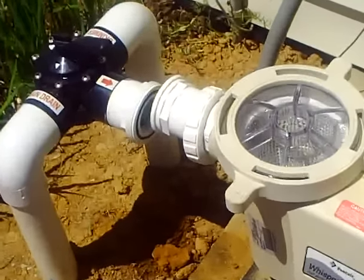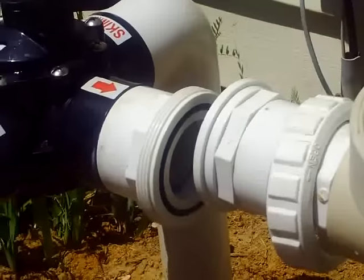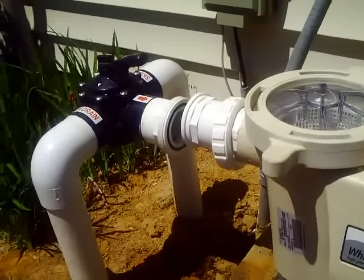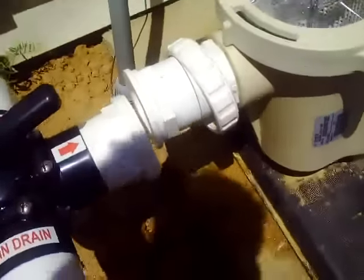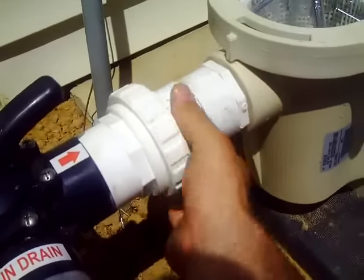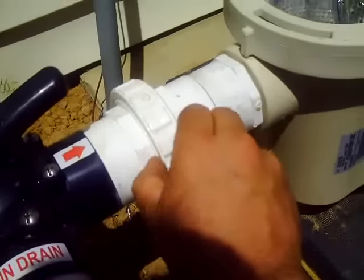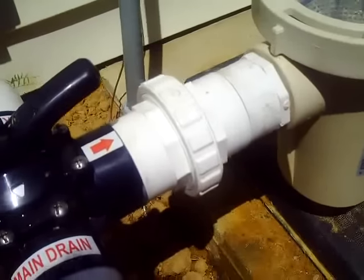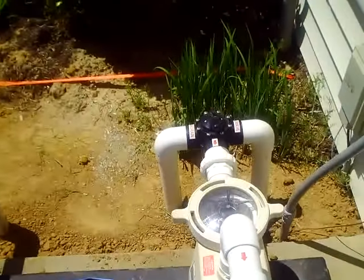One other angle of our union here — you can see that O-ring needs to seat in that little groove. From the back side, when I took the nut off, it wasn't in the groove at all; it was sitting out of it entirely at the top of the union. So let's put this back together. We'll pull our pump over, meet it together, and tighten our union up — nice and easy. If you look right here at this little flange, when you're finished tightening your union, you need to make sure that this is flush with the back of the nut. If it's not, then something is obstructing the union from fully closing — which is what was happening before. That O-ring was in there stopping us from getting it where it needed to be.